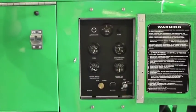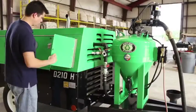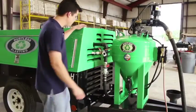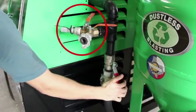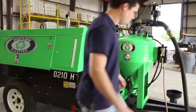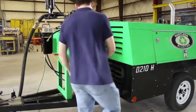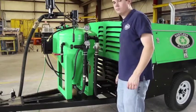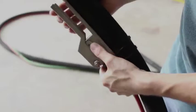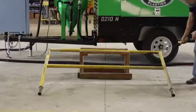Release the bypass button after the engine oil pressure gauge shows pressure. Let the compressor idle for a while, then turn the dial to the run position. Open the compressor outlet valve. These other two connections are auxiliary outlets. Close the blow-down valve. Open the air inlet valve. The machine is now ready to blast as soon as you depress the dead man.